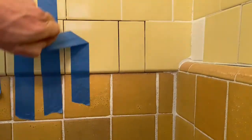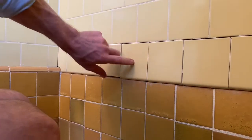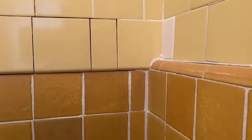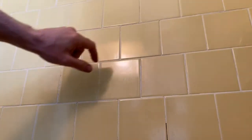So it's the second day — it's been 24 hours and the tape is going to come off. Let's check this. Listen to that — can you hear that? Just clunk, thunk, thunk, thunk — that's what you want to hear. There are some other tiles here — it's not my job — but listen to this compared to this. Hear that? That's what you don't want to hear. We've got a time constraint — tenants are coming. We're not going to fix those; I might be back to do that later.